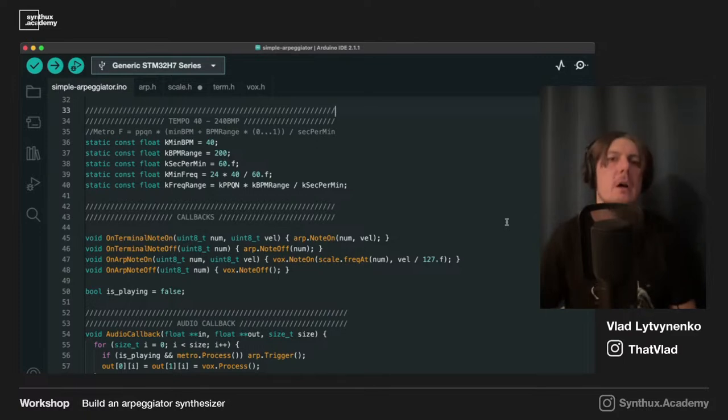I was looking around and, as I said, I caught this idea that a linked list can be used for this in that Mutable Instruments code. And I thought, okay, I want to try it. I more or less built it my way, how I would build it. So it was just a design decision. I didn't try to build another version with just an array and benchmark against it. I can imagine this benchmark will really depend on the number of nodes, because for a small number of nodes, probably an array will beat it.